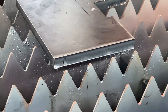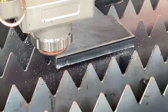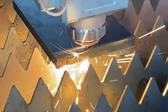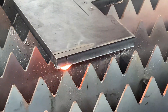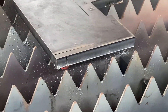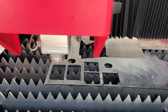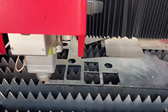For a 2000-watt laser using compressed air, I think 3mm is the maximum thickness for good processing. Please don't ask your machine to do work reluctantly beyond its capabilities. Next, we give a trial cut of 4mm carbon steel — our first goal is simply to cut it through.